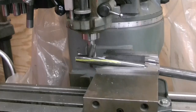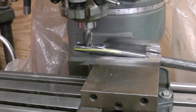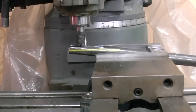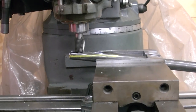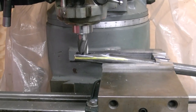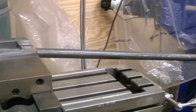Here we are milling the upper part of the ladder bar where it welds onto the lower bar. We're milling an eight-degree angle in it — it's probably a little excessive using the mill, but it actually works pretty good. So that's what we're doing right now, then we'll weld them on next.